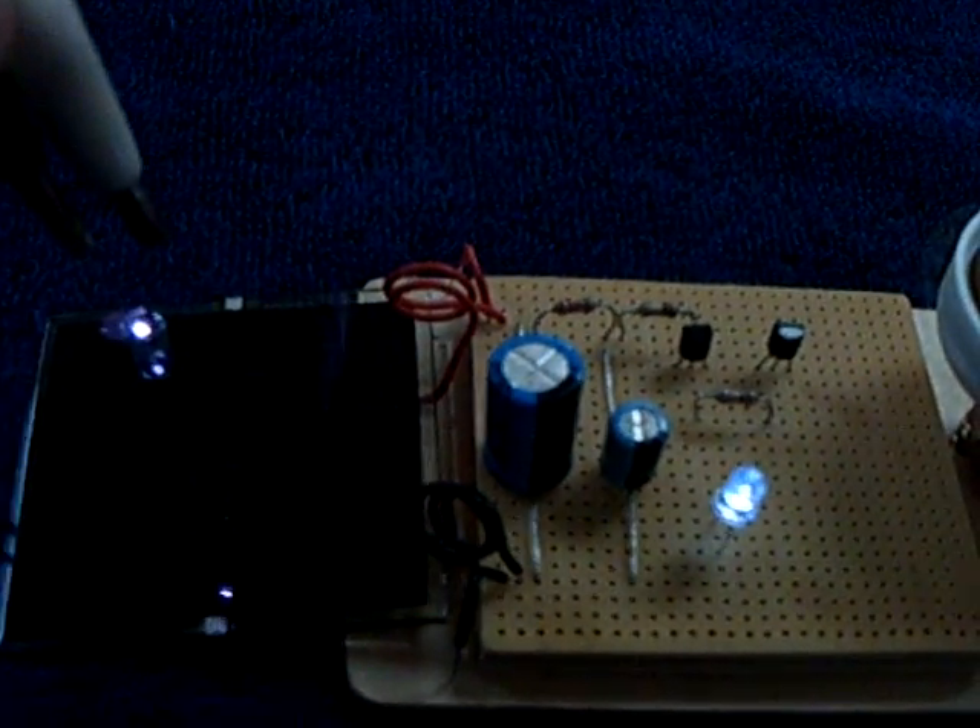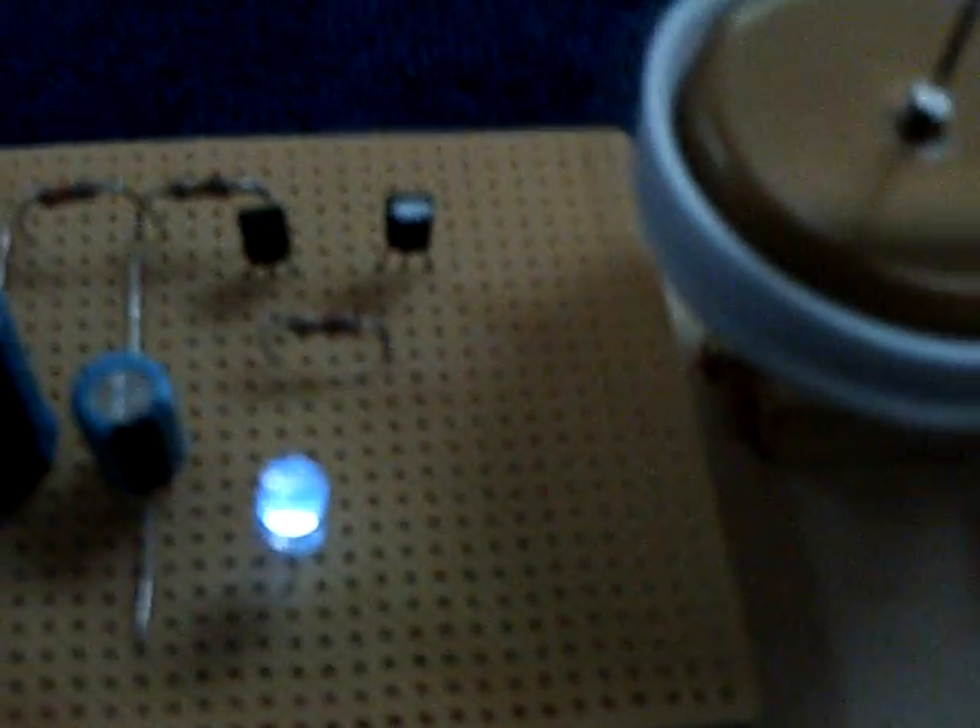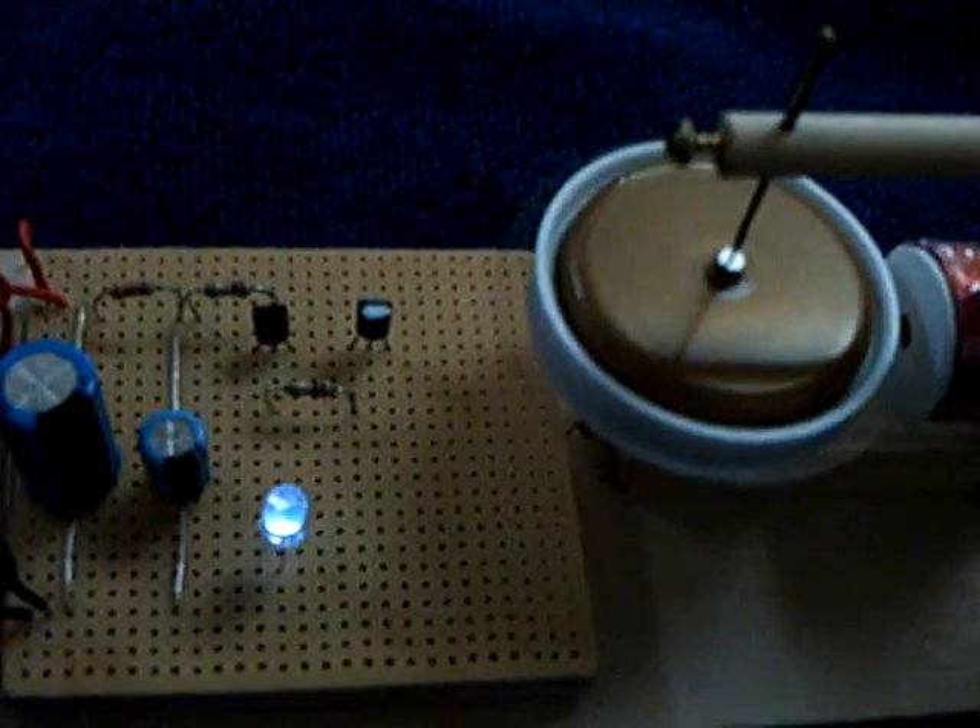My first thought when I saw this was: why don't I just take that LED right there, replace it with the infrared, put the infrared over this panel, and then it'll be a self-runner? But it doesn't work like that. This thing here has drawn about 100 milliamps, and that's way more than that LED is drawing.